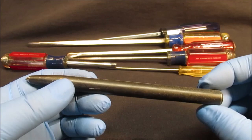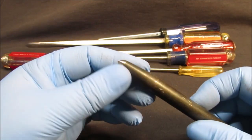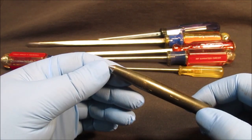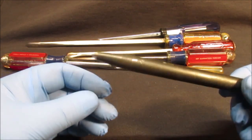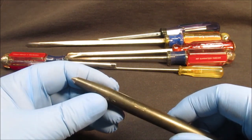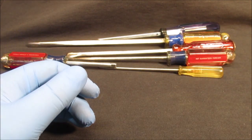Okay, this is stress-proof steel. Every time I showed it, I can't tell you the number of it. I'd have to look it up. This is my favorite center punch. This will put a center mark on hard steel where the other ones will fail. And this is all heat treated on my own. This had gun bluing on it. I can't tell you the diameter, but this is called stress-proof. So I can't tell you the number of it.